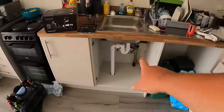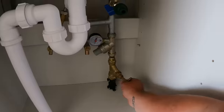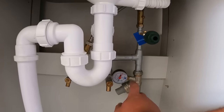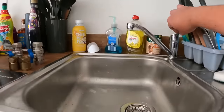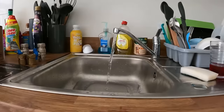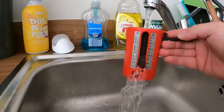Let me take you through exactly what the problem is, because he has got horrific mains water pressure. Stop tap out the front is open fully. They've fitted a pressure gauge on it; the pressure reducing valve is turned up to full. The incoming main is barely just over a bar and a half before I turn the cold tap on, and you'll see it drops down to about a bar. This is the first outlet — the kitchen tap — straight off the system.